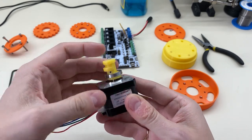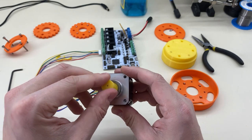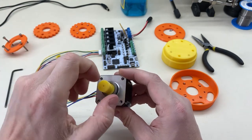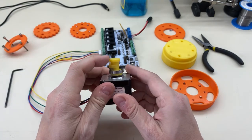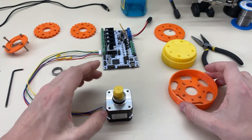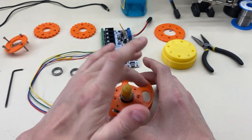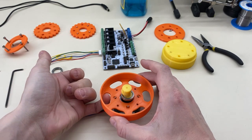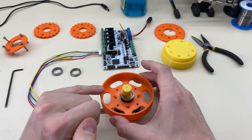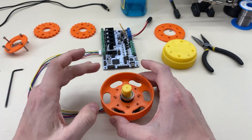It is pressed onto a flat side that has been cut on the shaft of this motor so that there's no slippage between them. This little hole on the end is here so that if this is pushed all the way in, there isn't an air pocket in the back, and there's a way to push a tool in there to help release this part when you need to remove things. Moving on, this is the frame. I cut these holes in the outside to save on plastic, but it's also really convenient to look through here to see inside the gearbox. I'm thinking now that this edge should have had some side holes to look between the gears when it's assembled.